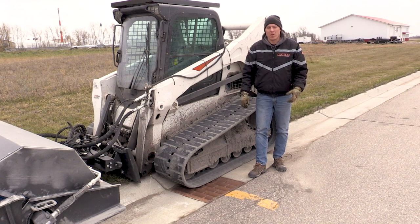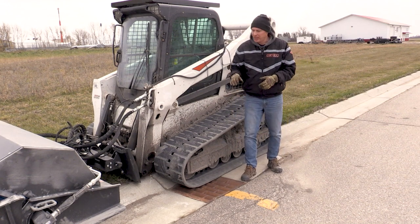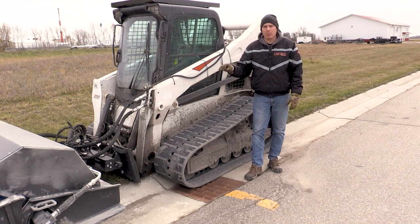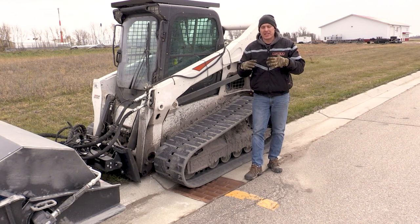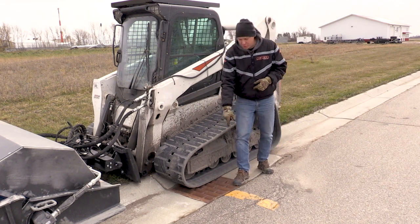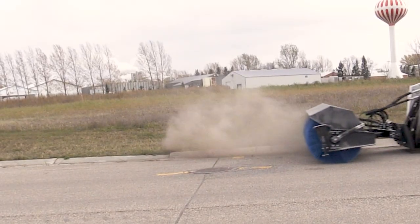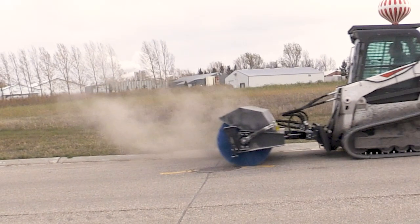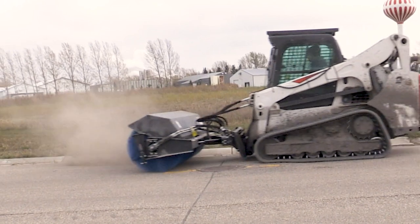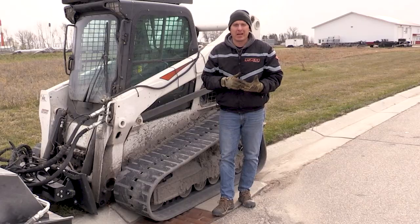This oscillation joint is really beneficial if you're sweeping transitions between two different angles of the ground. I wanted to show you the advantages of having a broom that has a flexible mounting plate on it. We use a torsion spring system which has built-in dampening, and what that allows you to do is when you drive over humps like this one near this drain, the skid steer is going to be jostled, but the broom will stay in contact with the ground so you won't have any skips, or at least it will reduce the amount of skipping. That really saves a lot of time because you don't have to go back and go over stuff twice.